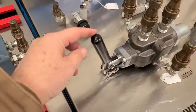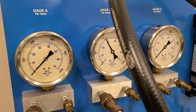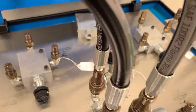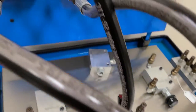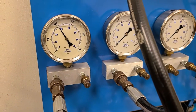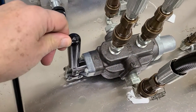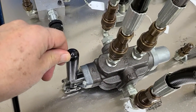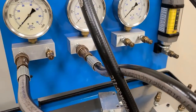I'm going to move this handle out and we have pressure on B. If I move it in, I have pressure on A. So on this one, as the handle goes towards A, we get pressure on A. When it goes away from A, we get pressure on B.